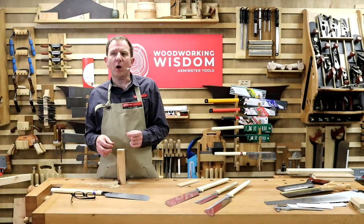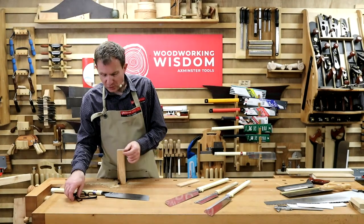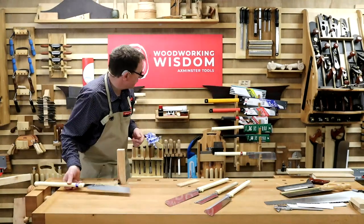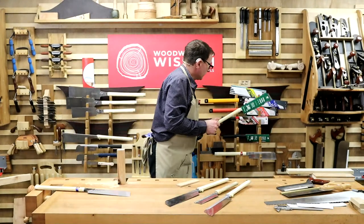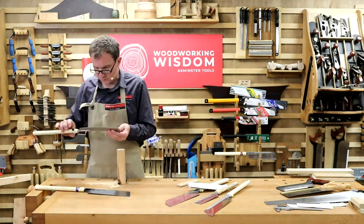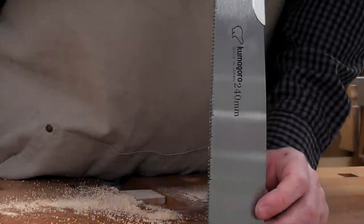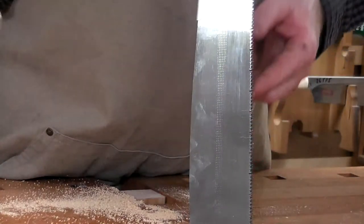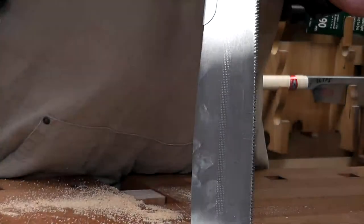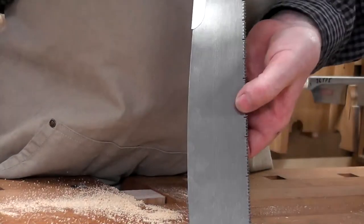They now do a thing called pulse hardening, which actually it's a great time to show you, because I picked up this as a rip cut. I'm trying to think of what I've got maximum color on. We do a couple of things on the saws we have. Let's just drop the pine down, because I think the apron will be a better backdrop. Turn it round so you don't get the label. Can you look at the teeth? Can you look at the blue colour on the tips? Each of the teeth looks like it's hardened individually. They are pulse hardened, which gives us hardness, which will retain its edge. Just the tooth.